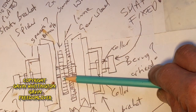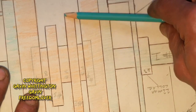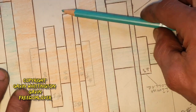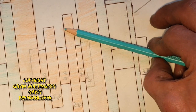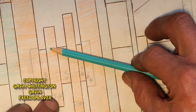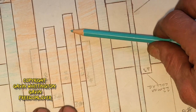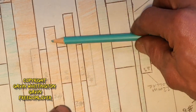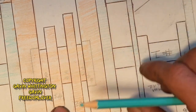These two are the plate gears that receive the chain from the upper shaft, and I'm going to have two different drive wheels. I've put one as a 20 tooth and one as a 36 tooth, because then I'll be able to run it in different modes. If there's low wind, I'd run it from the chain to the big one — similar to a push bike. If there's high wind and there's more power to be had, I'll drop it onto the smaller gear to really take advantage of that.